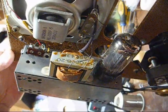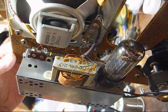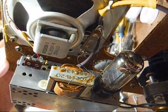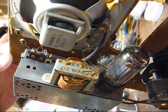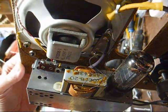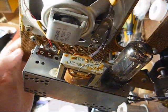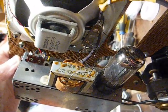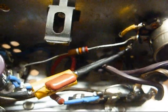Okay, here's our amp chassis. Now take note there is an alternate tube preamp circuit that you can use on this, and if you're interested in that, you can pretty much look through the Sam's Photofacts and just find one of the 2 or 3-tube RCA Victor 45 players with a 6AV6 tube in it, and that'll give you a suitable circuit for that. But in this case, we really don't have any room on the chassis to put such a thing, with the output transformer right there in the way, and under here in this area we've got a bunch of components, so in cases such as this, it's better just to use the FET circuit that is really simpler to build and takes up less space.